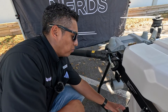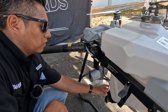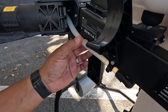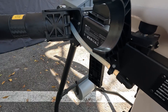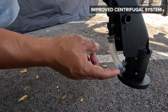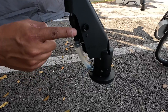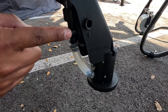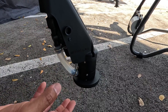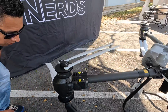At the bottom, they improved the way the pumps work and increased the flow rate. With that they also increased the size of the tubing. You can see it in the back on the new and improved centrifugal system — thicker lines to compensate for the increased flow rate. They also added what they call a solenoid valve to prevent leakage. Before on the T-40, when you stopped spraying you'd notice it dripping. Now with this new solenoid they prevent that — they call it new leakage protection.